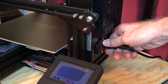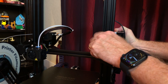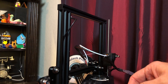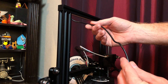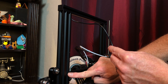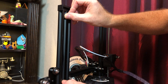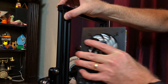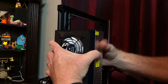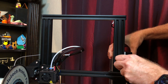Make sure the printer is turned off and unplugged, then loosen the screws holding the power supply up against the frame. Set the power supply down on the bed, then tuck the cable in. There are two V-slots on the back of the upright — one has the holes for the power supply screws going through it, so don't use that one. Use the one that doesn't have the holes in it — it's the one furthest from the bed. Once you've got the cable from the LED strip tucked in, carefully press the power supply back against the upright, making sure you're not pinching the cable, then reattach the power supply with its screws.